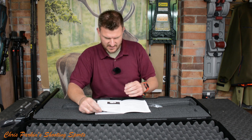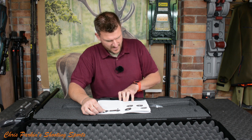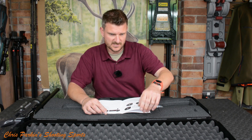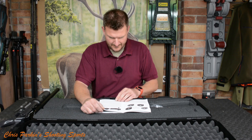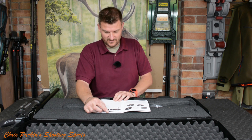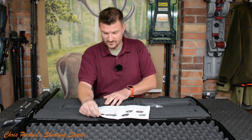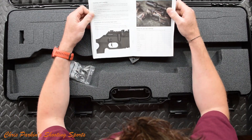Cleaning, storage, dry if possible — you can preferably store pressurised. Safety operations, how to load the magazine. They recommend JSB pellets, but I've got a selection including FX's own pellets, RWS, Acupels, and JSBs. On pressurising: only use female quick connectors from FX Airguns — use their recommended connector. If a hand pump is used, the moisture trap must be drained at regular intervals. Only dry air should be used — under no circumstances should oxygen or any other gas be used to fill the air tubes, as this could result in serious injury or death.